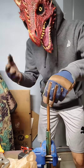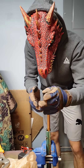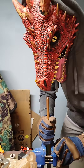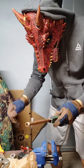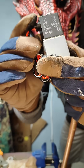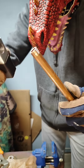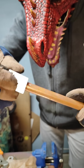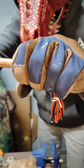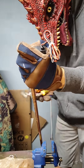It takes time, but as you can see it works. I remove everything and disassemble the construction. Now I take the solenoid and screw in the threaded pipe. Look at this beautiful clean thread I got. It didn't screw all the way in because I didn't cut the thread deep enough, but it fits tightly and securely.